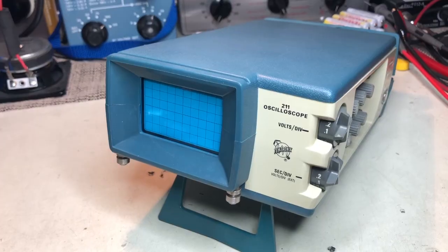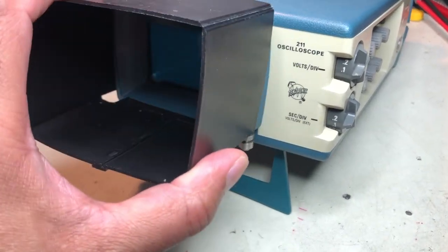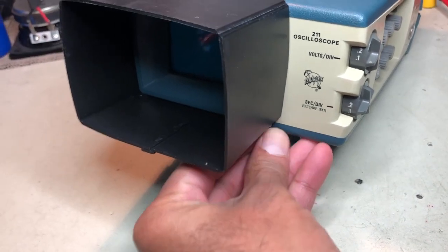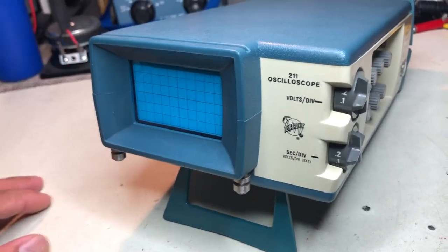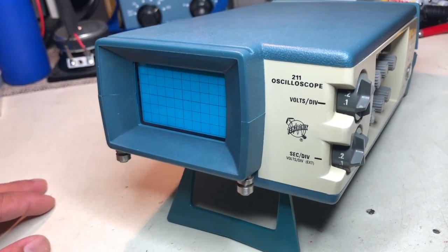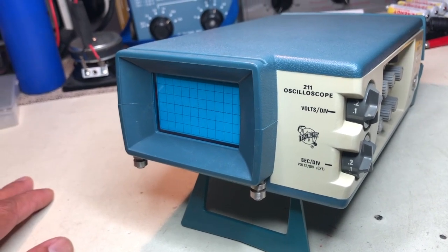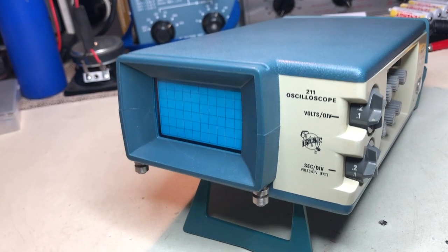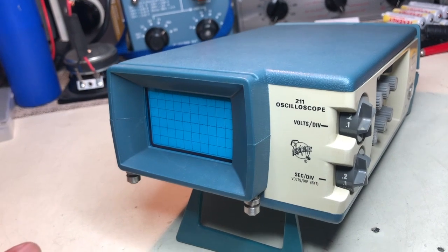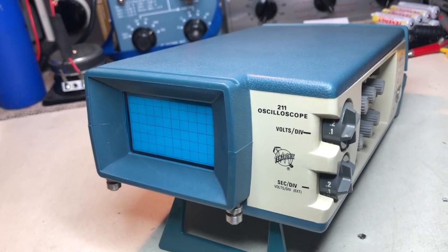That's how it sits. It comes with pretty good accessories, especially if you want to see the waveform when there is too much light around — there is a hood which you can bolt down here. I have already cleaned this, and the next step is to replace all the capacitors. There are stacks of bumblebees, black beauties, yellow dragons, and everything inside. I'll reform all the electrolytes and replace all the tubes inside.